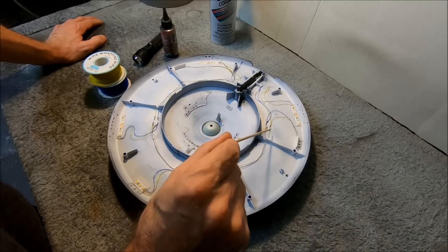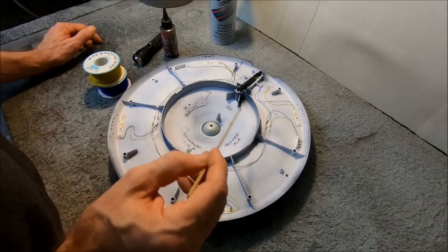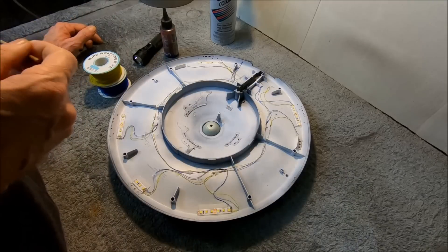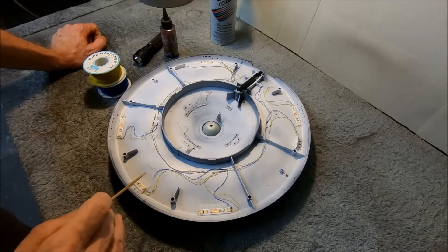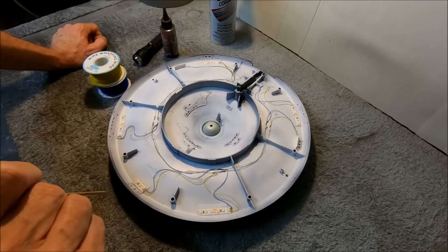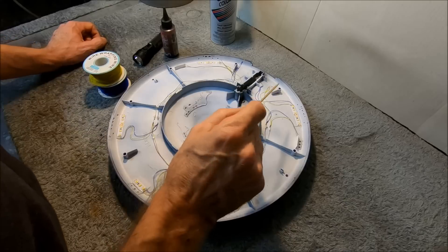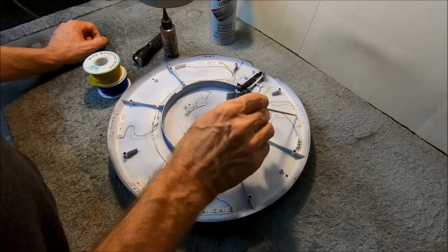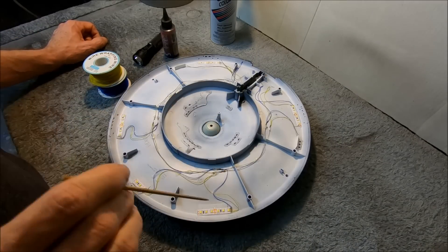To tap in, I just take my lighter, heat that up a little bit, take my finger and pull back the insulation, expose the bare wire, then wrap my wire around that and solder it. Once I get it all done, I glue it down. I'll also point out that on these individual LED strips, they do come with adhesive backing, but I never trust it. I've seen them where a day or two later you go to touch it and it just falls right off. The quality varies — the ones with the actual 3M label on the back seem pretty good, but some of the more generic brands don't have that. So what I'll do is after I get it in place, I'll stick it down with its own adhesive, then put a drop of CA glue on each end and in the middle, just to make sure it's never going to go anywhere. I finish the entire circumference here on the saucer and get them all locked down in place.